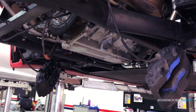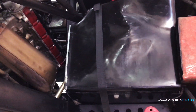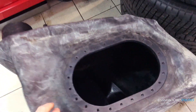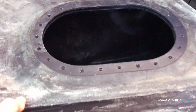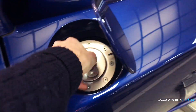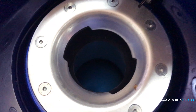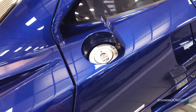This one has had everything come off. The first thing I'd point out is this case here, sort of semi-soft case, is for the fuel bags, which have to be changed every 10 years. And over here we have an old one that's just come out. They are these soft things — there's two of them, 80 litres in total. If you look in here, they have this foamy stuff, and the foam is there to stop the fuel moving around when you're going around a corner and affecting the balance.